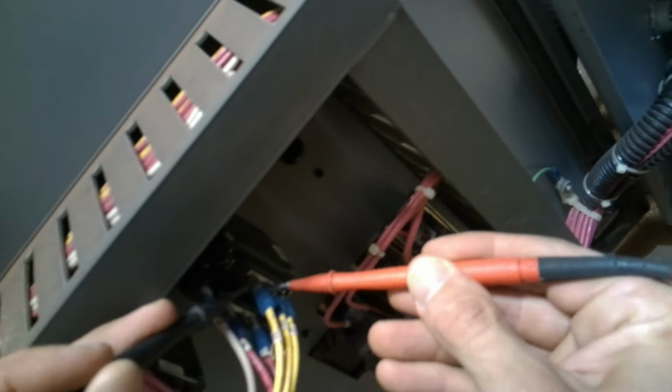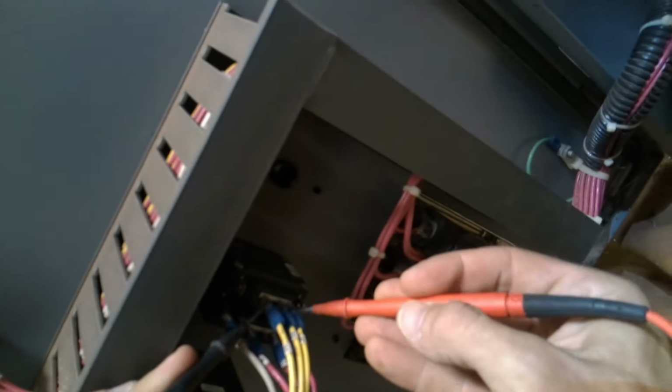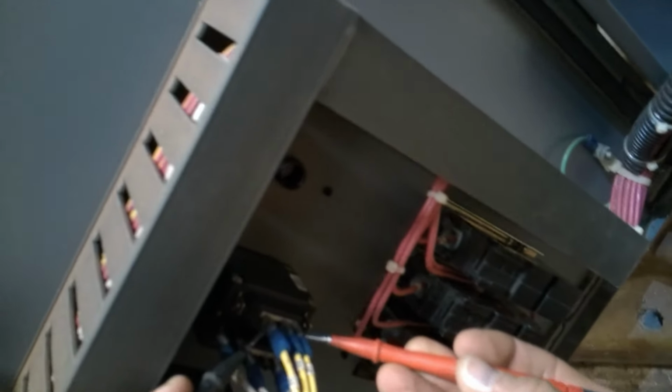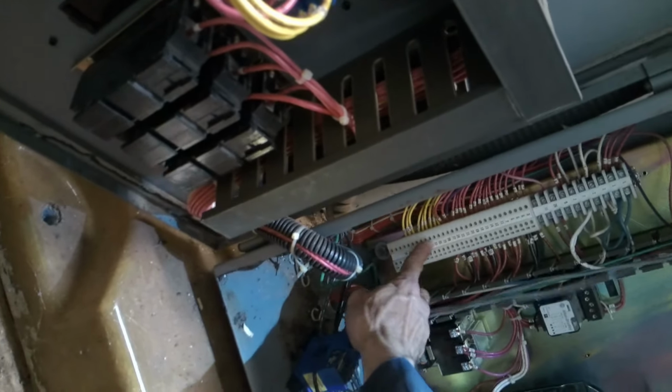During normal operation, it's fine. And then during a high fault, when it's tripped, hello, Mr. Wasp. You can leave me alone. There's your contacts there. So during a high fault, when it's tripped, 38 and 37 are true. So what the heck are 38 and 37 doing? They go into our door bundle, they run over, and there you go. 38 and 37, field wiring terminals, nothing landed on them.